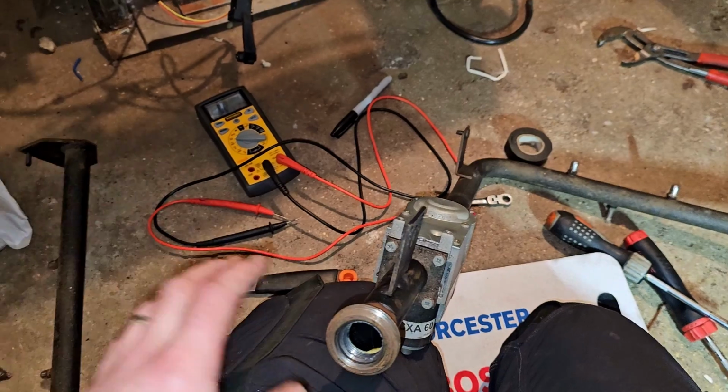The easy way to check that would be to have this front all open like this and use a taper to keep that pilot lit, or guarantee that pilot's lit. If the main burner then comes on and stays on, obviously without burning your arm off, then that'd be that. So we'll get to that in a minute if that's the case. Look what I've just spotted in here.